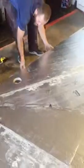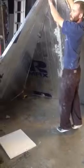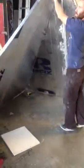So then the trick is, you have to flip it right side up. Once you have 3 sets of these, step back. You hold that side. You're gonna be gentle with this because see how it wants to lift up in the air? And we're gonna pull it out and set this down. Now you can see why we just tacked the inside. See this gap on the outside? If you'd tacked that, it wouldn't want to separate. This is why we lay them upside down and tack 2 and 2.